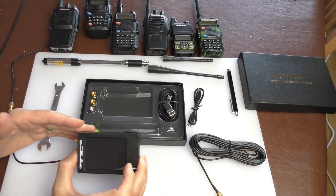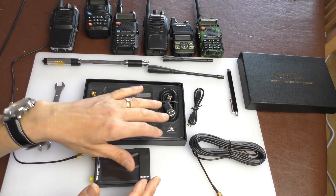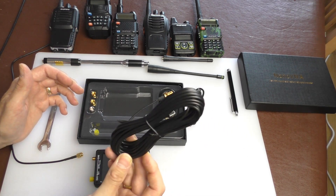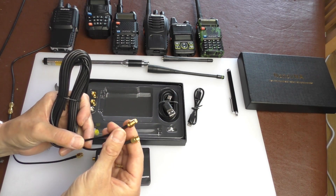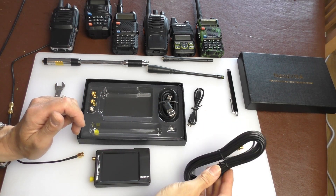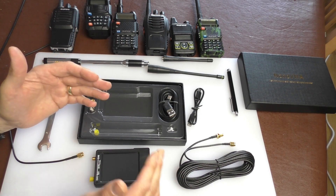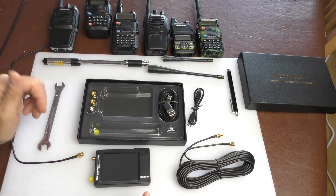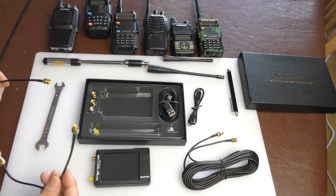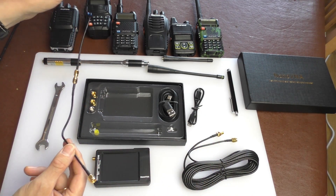People mentioned that when testing the antenna, because it was quite close to the meter, my body and the camera could affect the SWR reading — and yes, that's possibly quite valid. I did order an extendable lead, but unfortunately it came through with the wrong connections. I also thought about whether a long coiled patch lead could affect SWR due to its length. So for this test I'm using the extension piece that came with the VNA, giving twice the lead length to keep the antenna away from the camera and myself.